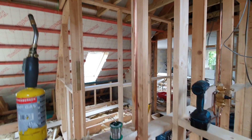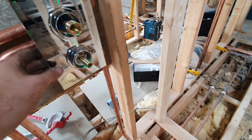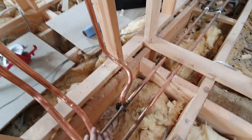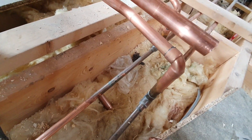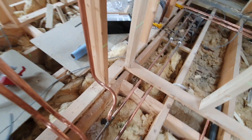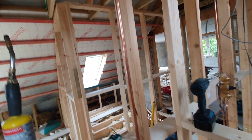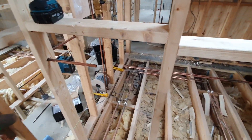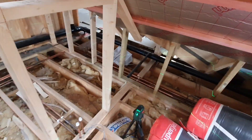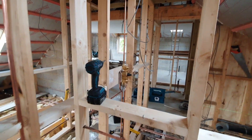That's the bath valve all set up, ready to go. I always take the chrome bits off when you're done, put them in your box, tape your box up, put it somewhere safe. Hopefully that one's low enough - if not I can sort it. They're all in, all screwed back nice and neat. Take your chrome bits off, protect them well. Just got the back plates to do, them pipes to move across, that waste pipe to get in, and then just that bathroom over there to do. Then we're pretty much first fixed up here.